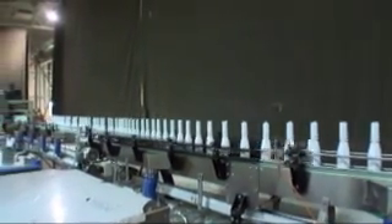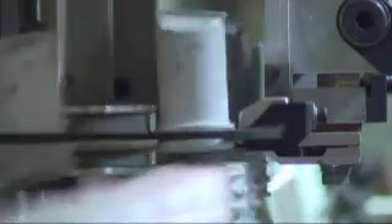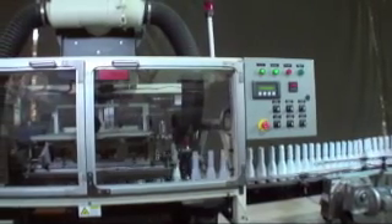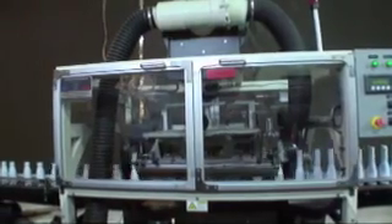The conveyor is sometimes replaced by an air conveyor that transports the bottles by the neck instead of the bottoms. Bottles are transported single file into a trimming system which removes the unused part of the bottle called the moil. The bottles are separated with a timing screw that prevents the bottles from hitting each other as they pass through the trimmer.